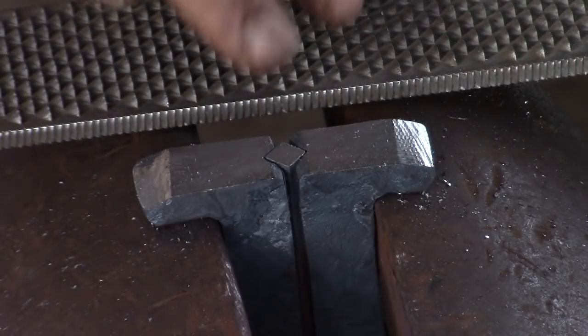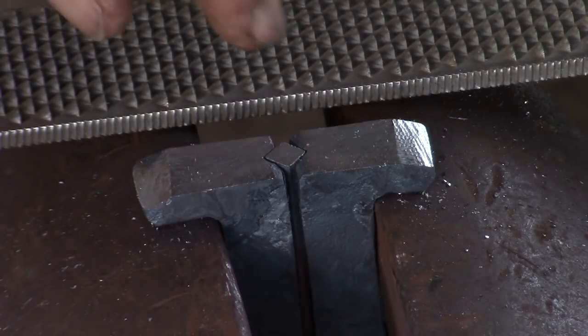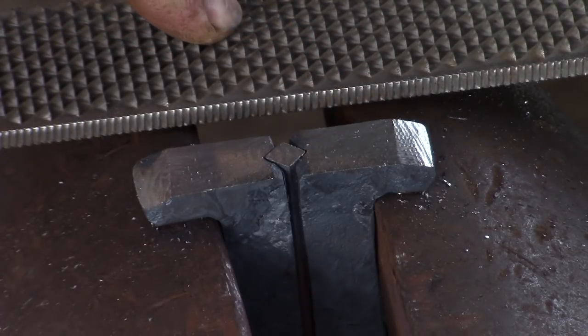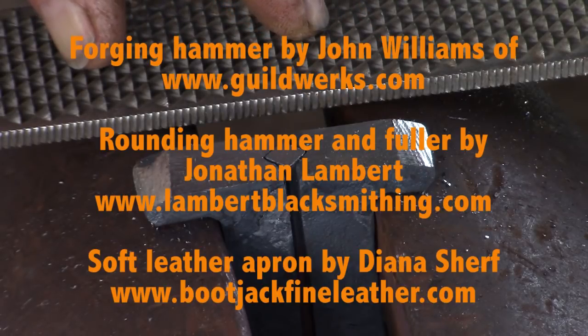You can see I've got a little bit more filing to do, but that in essence is the vertical filing vise. I would be tempted to case-harden that once you've finished, get rid of the sharp edges so you don't catch your knuckles on them, and then you're ready to make rivets.